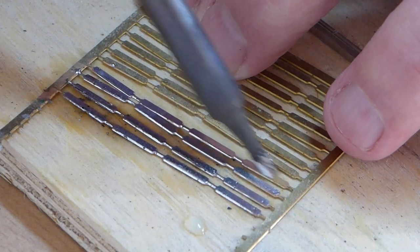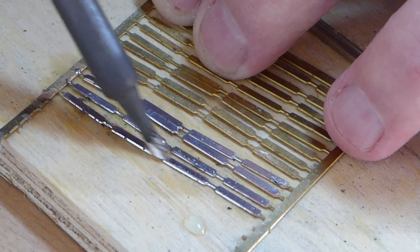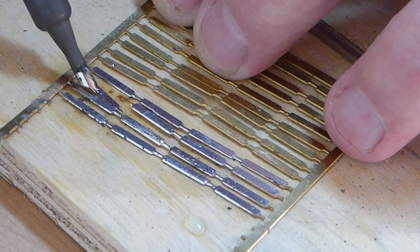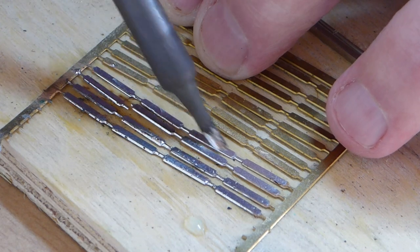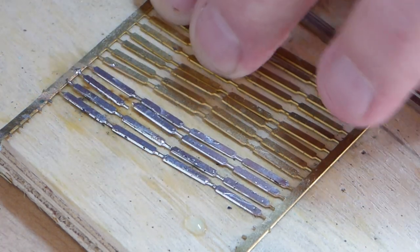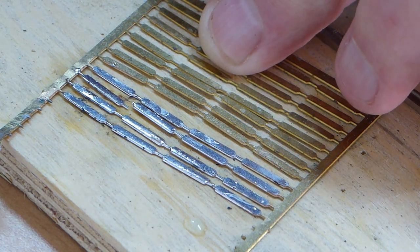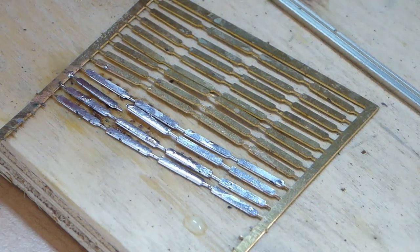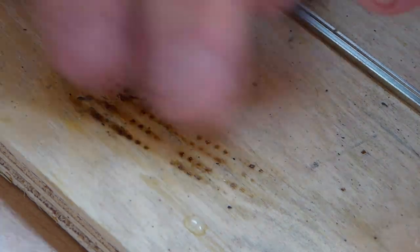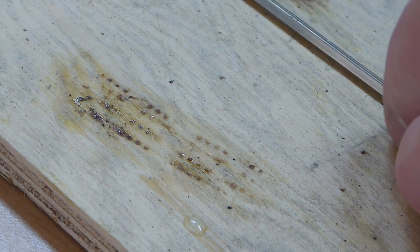And that's called tinning. I think it's something to do with the original solders being made out of tin. So just spread that all over. Like I say, them are just joined together a bit there. I don't want that. Make sure it's all over, they've got covered all over. Nice silvery shiny solder. Okay, I am back in our rest. Unplug our soldering iron. That's the tinning done. Left a few burn marks on our wood, but hey, who cares? Right, on to the next bit now.